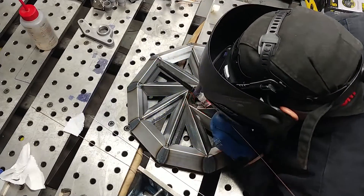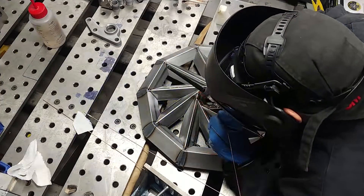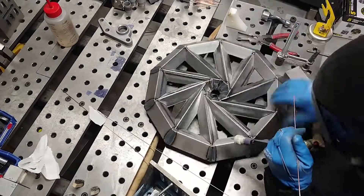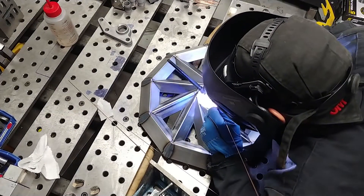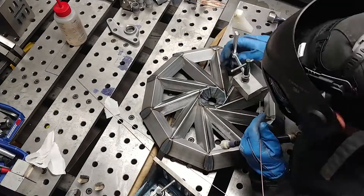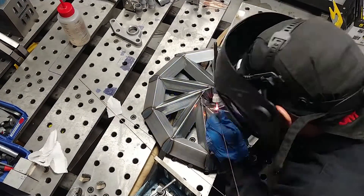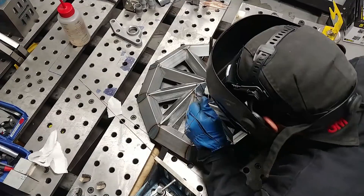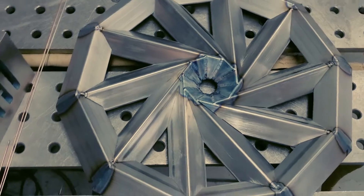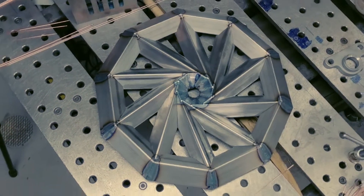I worked these inner joints uphill, indexing around and keeping an aluminum block there so I have something to rest my hands on. I could use the TIG finger here, and I did use it a little bit later. I just found that having a block or having these vertical clamps on the ProBuild table really put my hands in the right position — a lot of this is all about getting your hands in the right position to ensure your success.